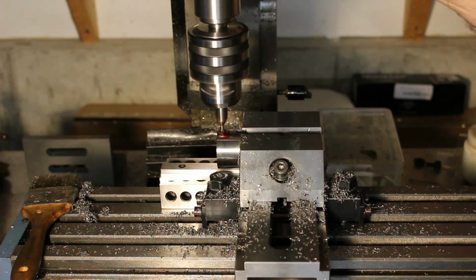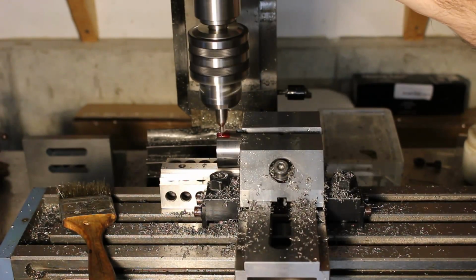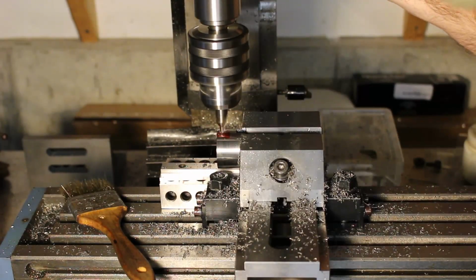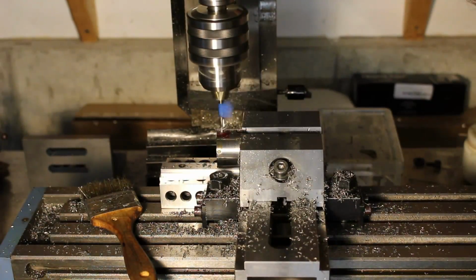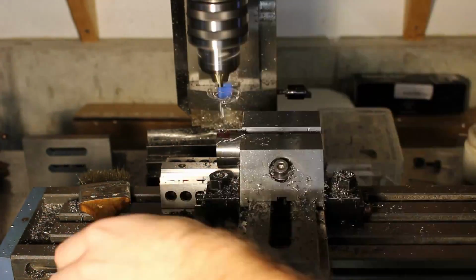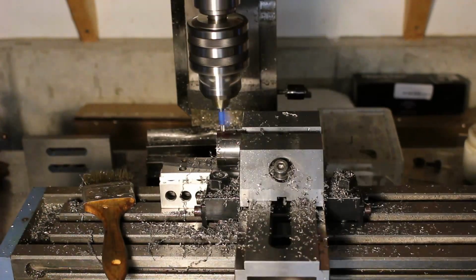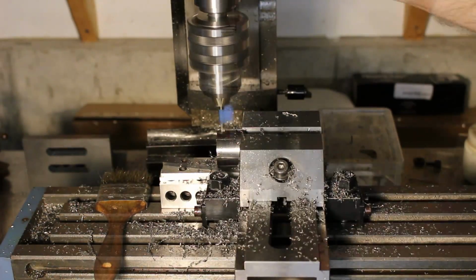The only machining left is for tool holding. So the holes to take the actual tools themselves, and the set screw holes. I'm going to quickly show drilling and reaming one of the 3/16 inch boring bar holes. Note the high-tech blue tape for controlling the drilling depth.